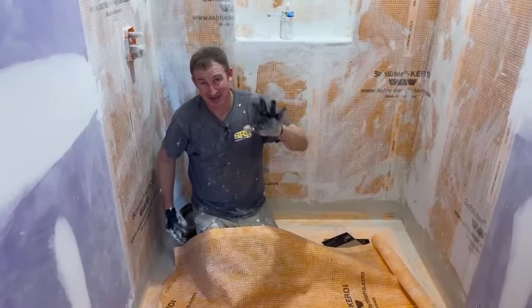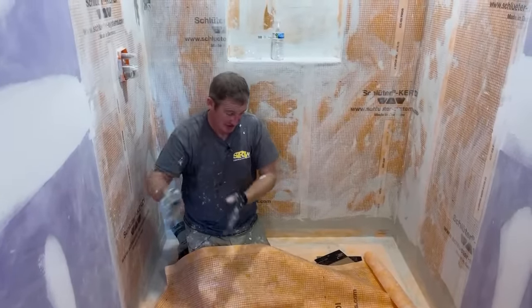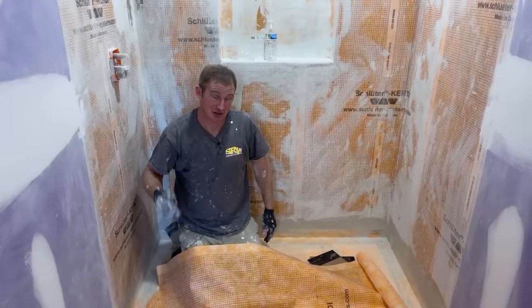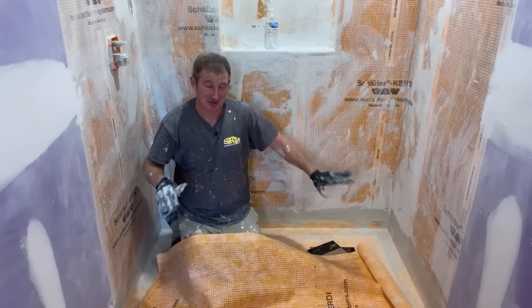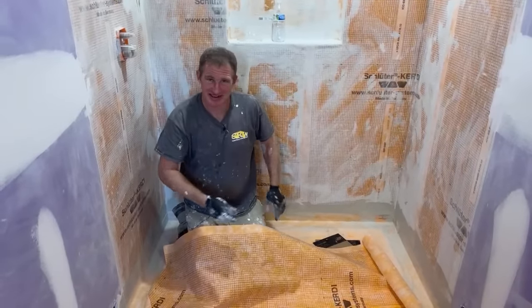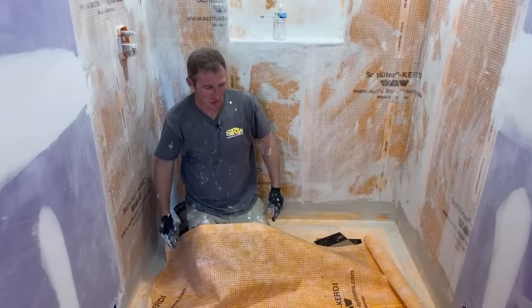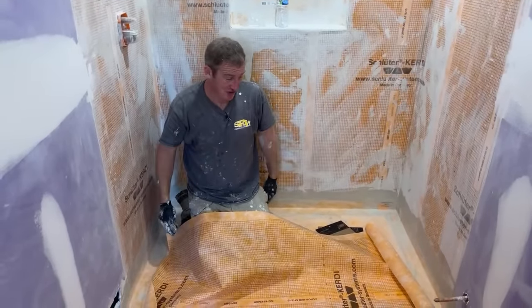The only thing about that is that you need a separate cable for the shower to meet Schluter's recommendations. You don't want to be just doing one cable for everything. They're just particular about the shower area. They just feel that if something went wrong in there, you just exit that and then you just at least have the outside floor. But honestly, I'm not sure exactly what could possibly go wrong there.